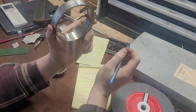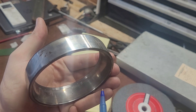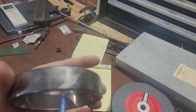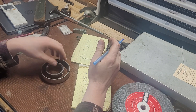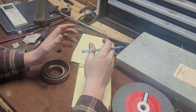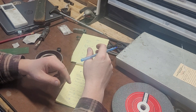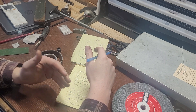This is a damaged bearing — this pitting in here. This is not from VFD wear; this is just a worn out wheel bearing from my old pickup. But motors running off VFDs tend to live shorter lives than running off perfectly balanced wall power. I would assume running off a rotary phase converter you'd get the same benefits as wall power, but you also get into the wiring complexities of a rotary phase converter. I personally do think the advantages of VFDs outweigh their disadvantages.